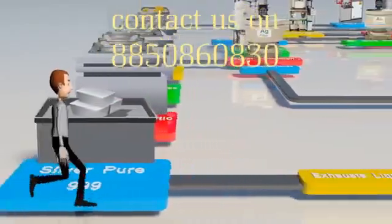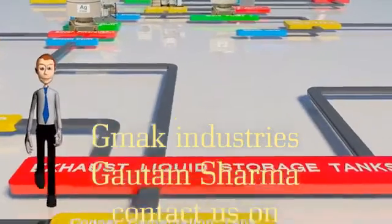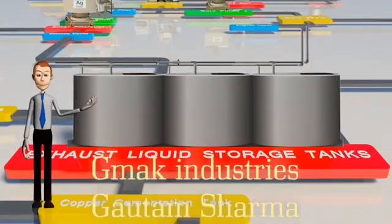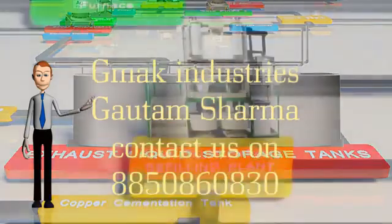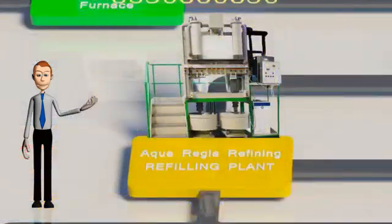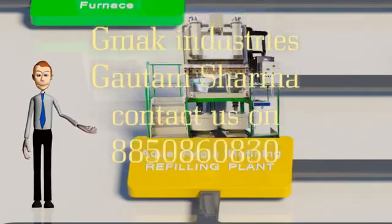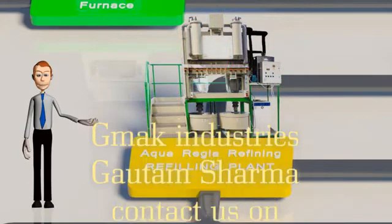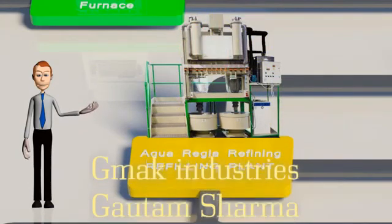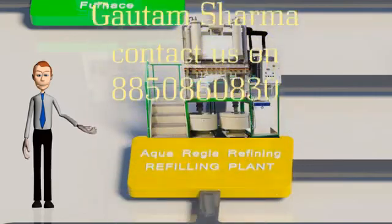The exhaust liquids after filtration of silver, and those from the electrolytic refining plant, are collected in exhaust liquid storage tanks. The clear gold chloride solution is transferred to another reactor, where sodium metabisulfite is charged in as a reducing agent to precipitate gold from the solution. This is monitored by pH control and a viewing glass reactor for the right change in color.